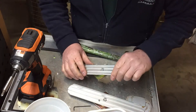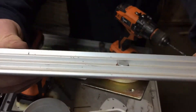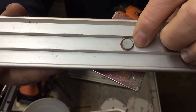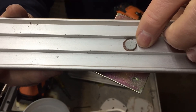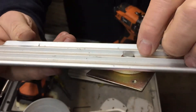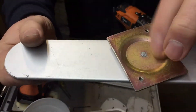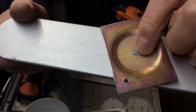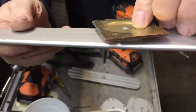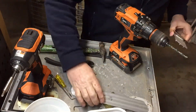How does this come off? Okay, thinking time over. The way this one works: that little rusty-looking bit I thought was a circlip is actually just a glorified washer. This pin in the middle comes through to this steel plate and is peened over to capture it. So the easiest way — hopefully — will be to drill that out. Let's do that.